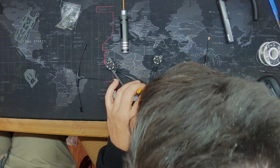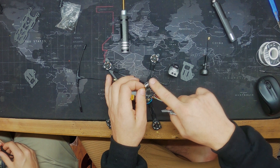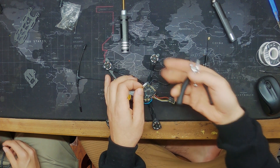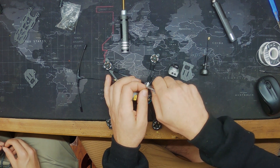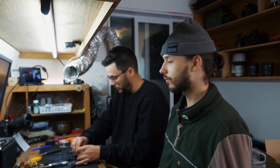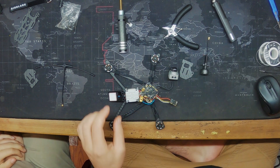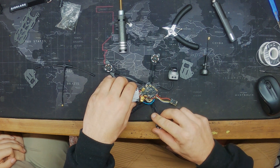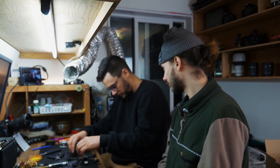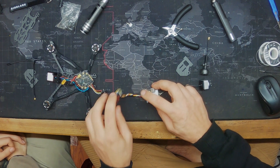The wires need to be cut to almost full length. If you were doing another build with a DJI HD-ready flight controller, they might plug right into that, but this board wasn't incorporated for HD. So we route these wires here, those go there, and before we do that we slide this guy up nice and gingerly, feeding it through the wires.